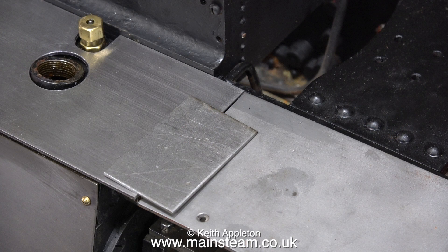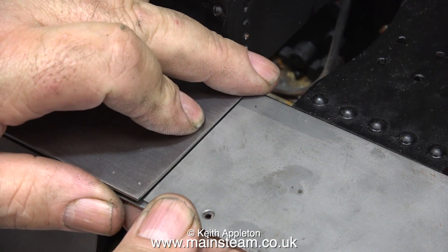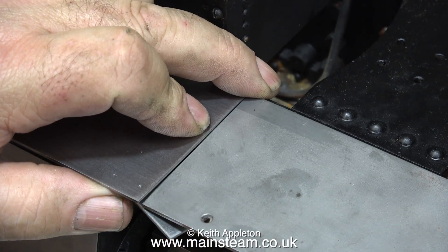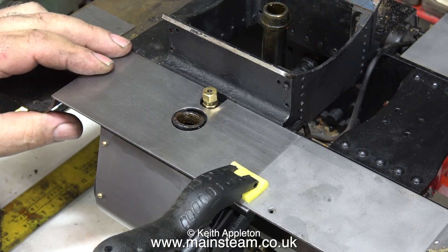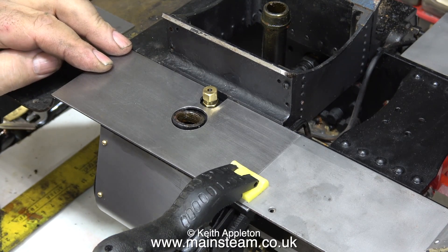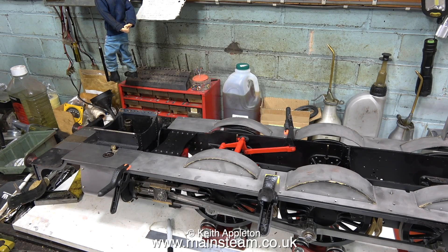I've made two steel plates that I intend to rivet under the longest part of the running board to support the short part over the cylinder, which will be held in place by a couple of short countersunk bolts. When I clamp everything together using a spring clamp, it looks quite good. I've also clamped in place the side valence. Underneath the running board at this side there's a lever that operates the drain cocks, so at this side only I will need to shorten the piece of metal that I cut to fit underneath, because it's currently too long and fouls the lever. As for the other side — I did make one, but it didn't work out, so I need to go up to Blackgate's Engineering and buy another piece of steel, and I'll get it right the second time.